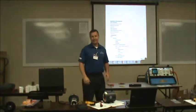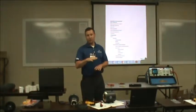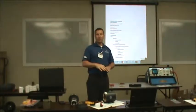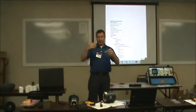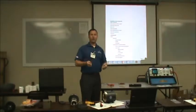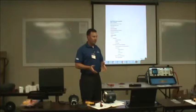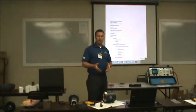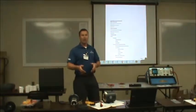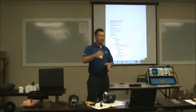That's right. It's going to have less load. The more pressure I put on it, the less it's going to pump, so the less the motor's going to be under load. When we repair a pump in the shop, a submersible sewer pump or water pump, we drop it in the tanks and pump it at full flow right out. So we're getting full load. I'm running this pump at its max flow, all it can do. Full load.